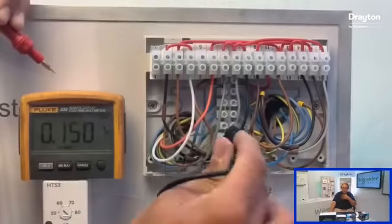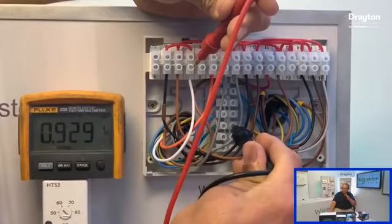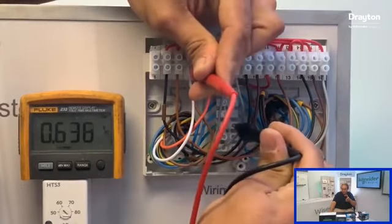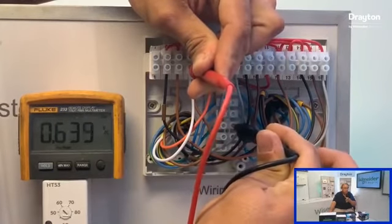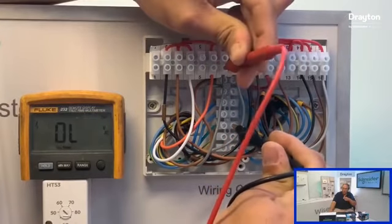So we set it up. We set for hot water, cylinder stat up to maximum. Obviously very helpful if you've not got a cylinder full of hot water, but immediately we can see here the reason why the cylinder's not getting hot is the valve is in the heating position. So now we need to understand and try to decipher why. Electrically, we'll test to see what's going on.